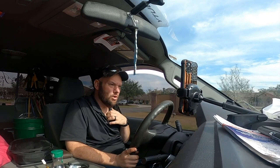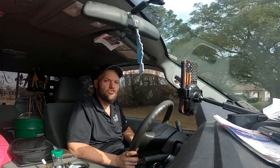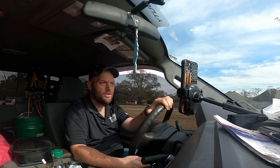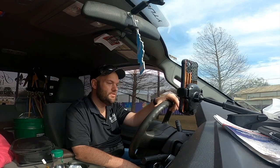Hey guys, we're on our way to go change out a condenser fan motor on an ICP condenser. It's a 2021. A couple days ago, we replaced the furnace and the coil. I was outside pumping the refrigerant back into the outdoor unit. I pushed the contactor in and I noticed that the condenser fan motor wouldn't run. But it was cold enough that I was still able to pump it down with just the compressor running.